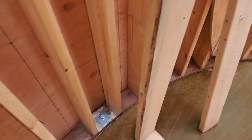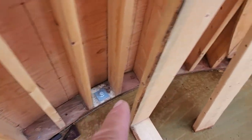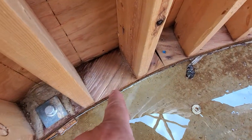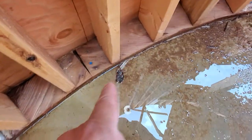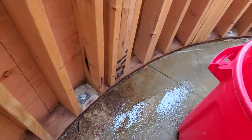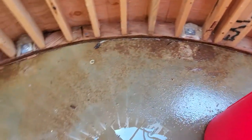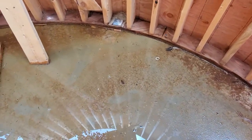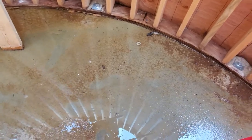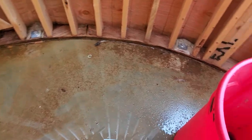Well, we got a couple things happening here. What we do is take plywood for your bottom plate right here — just a couple pieces of three-quarter inch plywood. We would like to see this plywood be treated material, but it does not look like this plywood is treated. Anytime you have any kind of wood sitting on concrete, that needs to be treated wood.